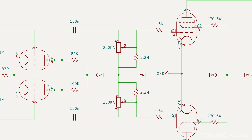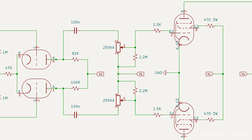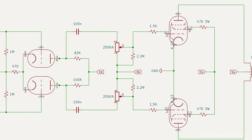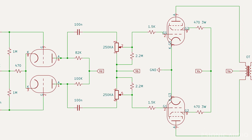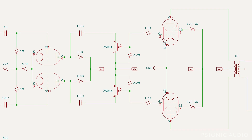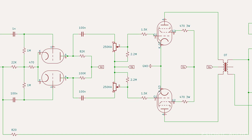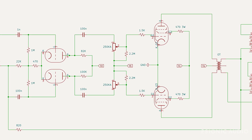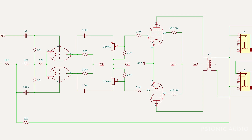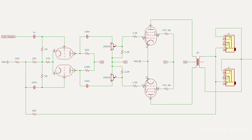As you turn it all the way down, the negative feedback loop begins to fail. Below 10 o'clock, that's when you really begin to hear that. But a lot of the artifacts you hear in an amp like an AB763 — or even in this case the AA-864 Bassman — there's enough happening with physics, how our ears work, and how speakers work, that you're going to have compromises below 10 o'clock anyway. It's not going to be perfect — there's no perfect solution with any master volume. But for making it musically useful without getting evicted, it's great. If you're always turning a 100-watt amp down to barely on, you may need to get a 10 or 20-watt amp as well. Save the 100-watt for big gigs.